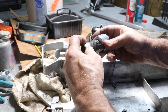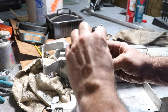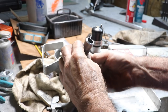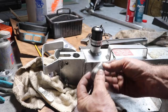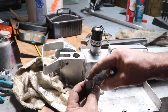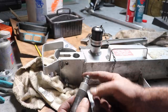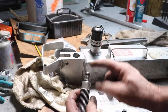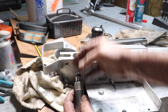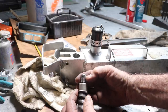There we go. Yeah, there was something on there. Might have been dirt. Anyway, we'll take the nuts off. There's the sleeve off of there, and then you have to insert the pump this way. Down here, there is a small chamfer they have on the end here on the inside so that this will slip in properly. This is a one-way kind of direction seal here. It basically has a slight flare out to it, so you have to put it in this way. It almost looks like it's been tried the other way.